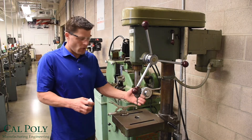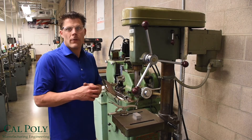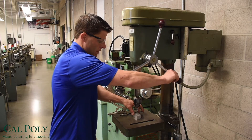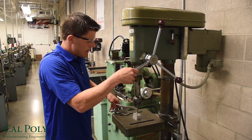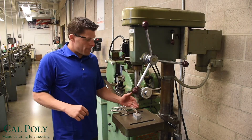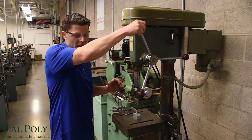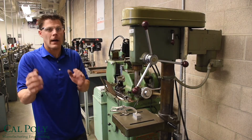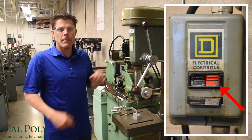To machine a hole we need a workpiece. Place your workpiece down on the table, already center punched with the location of the hole, and without turning on the drill press line up the center of the center-punched hole with the center of the drill bit. Then use your clamp to clamp it down to the table and make sure you're still aligned. If the drill press jams while drilling, maintain position — don't raise the quill back up — and while maintaining position, turn the drill press off. To turn it on and off there are two buttons: the black button starts with a clockwise motion, and the stop button turns the drill press off.